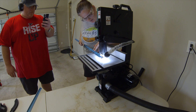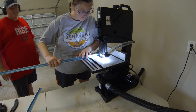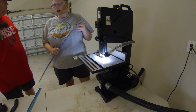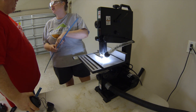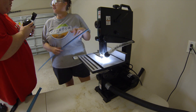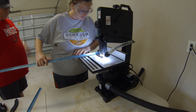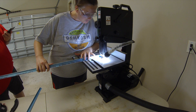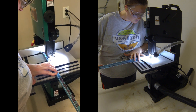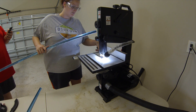So right before I started to make the cut, I suddenly realized how long this was. It was a 16-inch cut and I decided it would be smart to put some relief cuts into it. I was really glad Ty stopped me because it's important for both of us to be on the same page and agree with what we're doing, because this wasn't something that was in the instructions. I wanted to make sure to put some relief cuts so that if I felt like I needed to move my hands or change my grip, I didn't have to back the saw blade out all the way out of a 16-inch cut. So here you can see that I'm cutting these tiny little relief cuts, going perpendicular to it just to allow for that little piece to be able to come off.